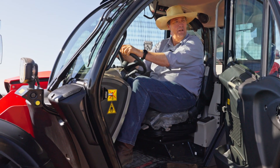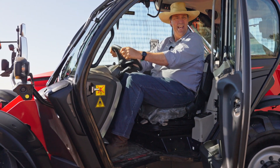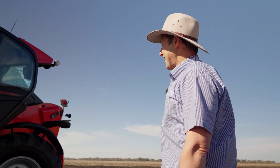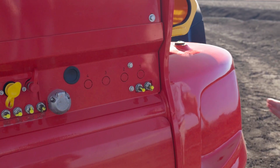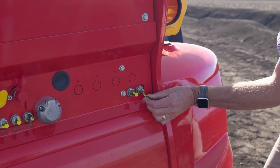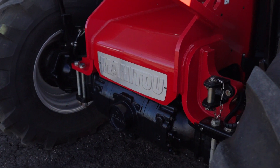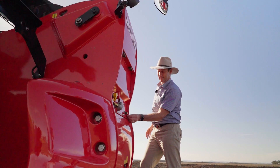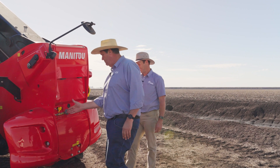This machine needs a lot of lubrication — there's a lot of moving parts, joints and all that sort of stuff. Lubrication's very important on a telehandler. Around at the back of the machine, we have the central lubrication position, lubricating all the main grease points — our boom, our rear axle, and so on. And if you want to take it to the next level, we can put an auto greaser up on the side of the rear there. So no crawling under the machine to get to greasing — this is about as low as you have to go.